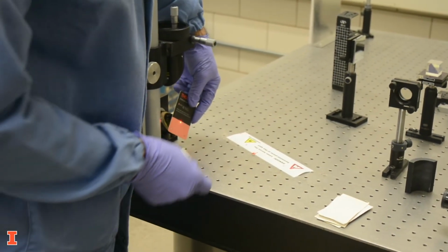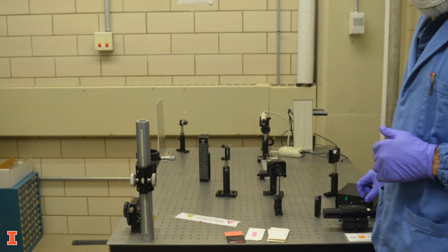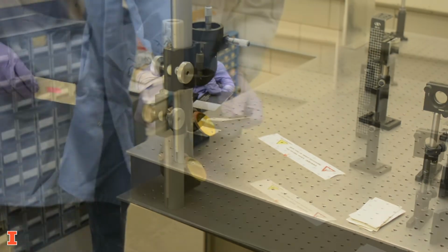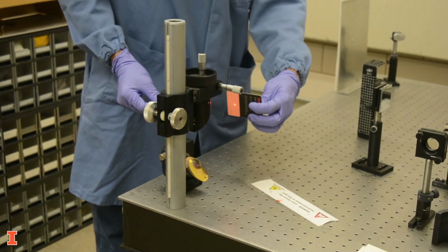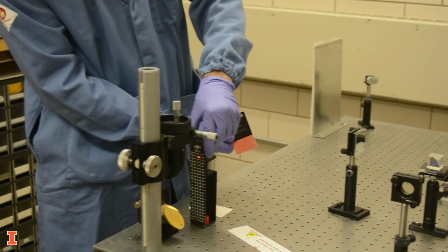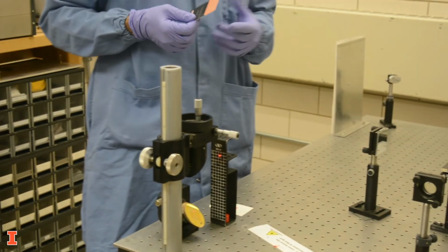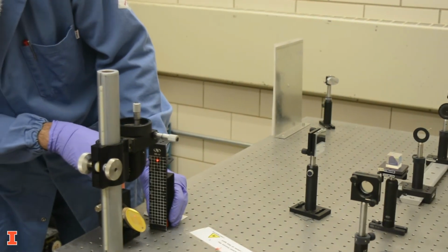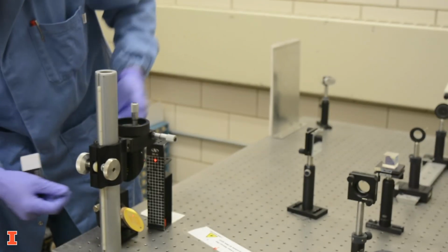It's important to keep control of the laser at all points during alignment. As you can see, if you lose control of the beam, this can easily result in multiple beams leaving the table. This can be a potential hazard to users' eyes, or if the laser is powerful enough, can be a potential fire hazard. For this reason, use a portable beam block to block the beam downstream from the component that is being aligned. That means block the beam just after it leaves the component. This beam block can be useful for aligning since it includes a 1/4-inch square grid.